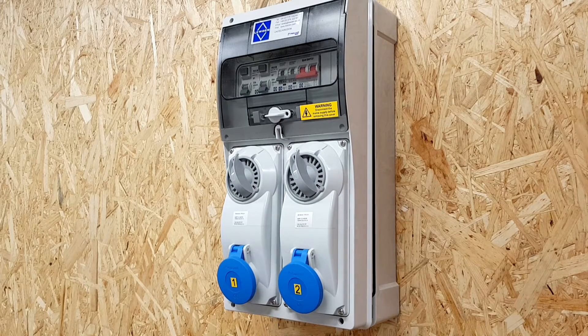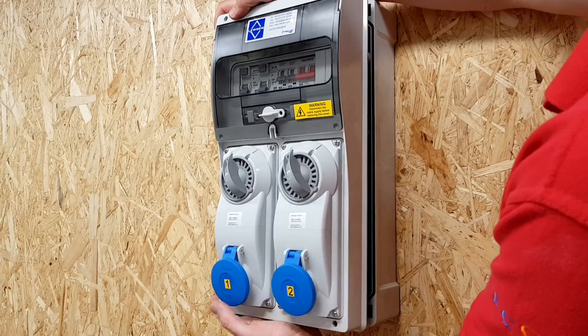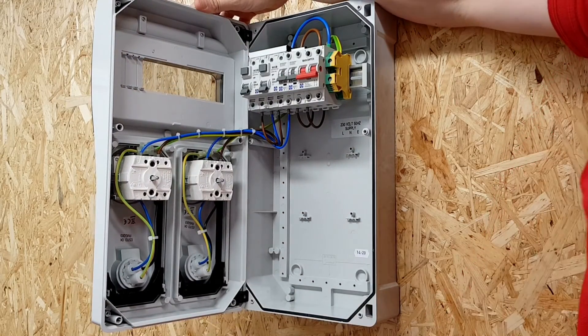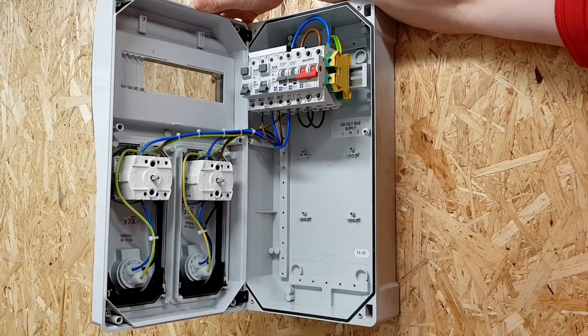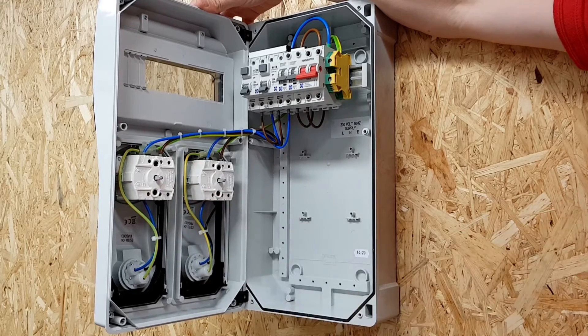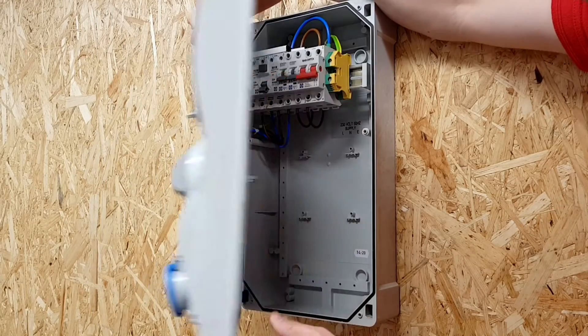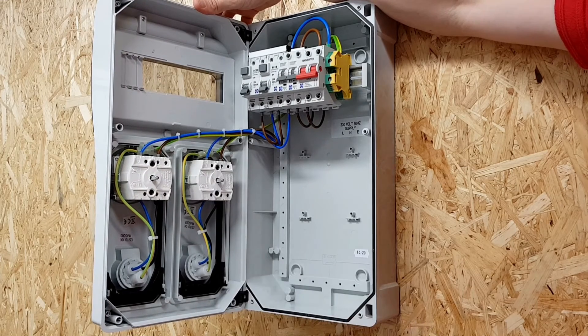That's a good overview of the range. Let's look at the inside of one of these assemblies in a little more detail. On most of the windowed enclosures like this one, the lid of the fitting is hinged. I'm sure we've all been there before — when installing enclosures with wired fronts, the front often gets left hanging by its conductors and ends up banging against the wall, getting scuffed and scratched. So the hinge keeps that from happening, and it also prevents strain on the conductors.